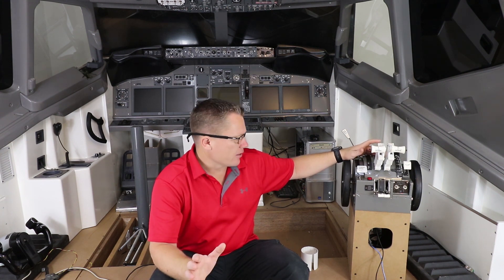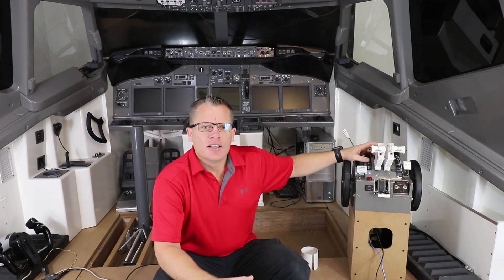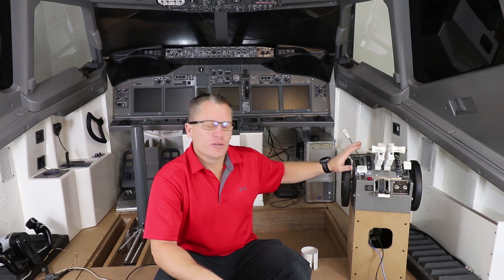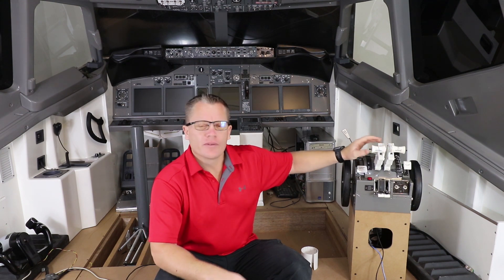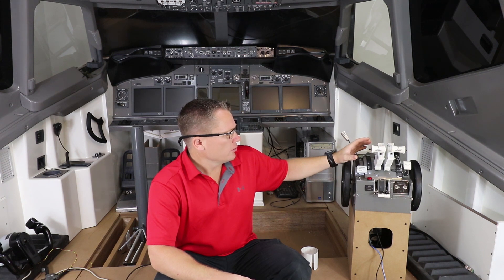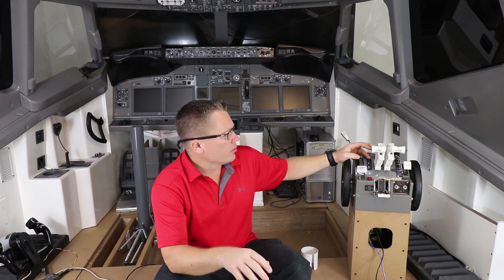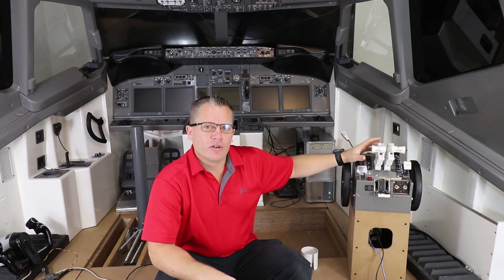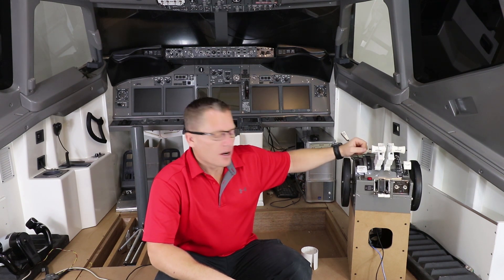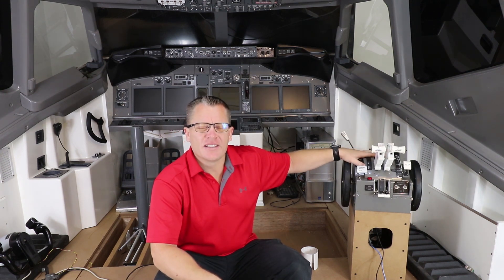All the encoders and potentiometers had failed so I took it all apart again replacing everything. I took all the servos out because it was motorized — not the trim wheels, just the throttles and the speed lever — but now it's just manual. It's stuck in manual at the moment and I'm going to use the servos for version 2. At least I've got a working throttle to practice on, and once the prototypes are fully working I'll share the plans.